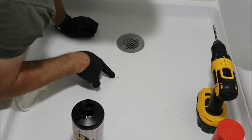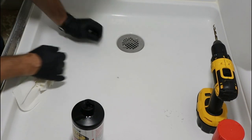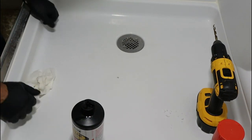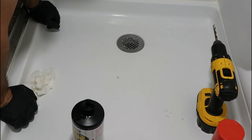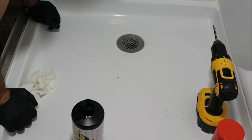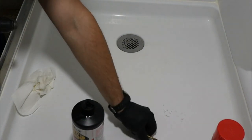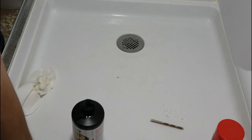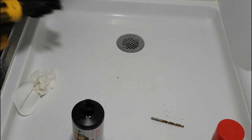Okay, so now I'm gonna get a vacuum cleaner, vacuum out the little shavings that are left in there, and then we're already gonna do the spray foaming, because that has to cure before I start pushing on here and sanding. And maybe I'll do the stop drilling, since we're at it, and I'm gonna do the stop drilling with a finer drill, about half the size.